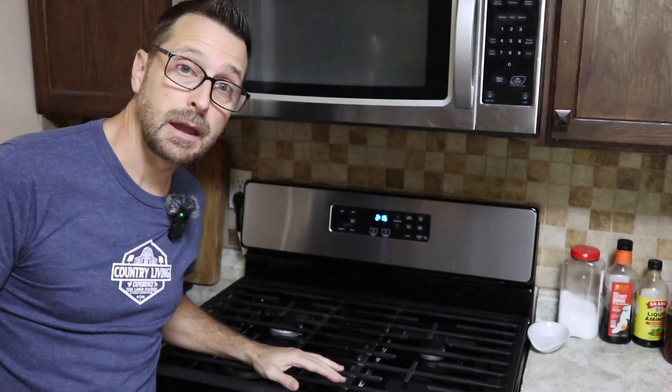To give you a little bit of context about what we are testing — this is our modest home, about 1,800 square feet. We've got all modern appliances except for our stove, which is propane. We heat and cool our home with mini split units: one 12,000 BTU unit in the main space, and a dual unit for two bedrooms — 9,000 BTU each — going to a single 18,000 BTU outside unit.